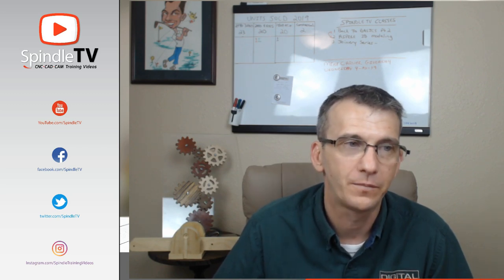This quick set block on this lower corner here is permanently secured and screwed to that corner. It never moves. And the other quick set block is a floating quick set block. If we were to look at the bottom, it actually is connected to a board that has two pegs, so that when I press it down in, it always lands in that corner, never varies, right?